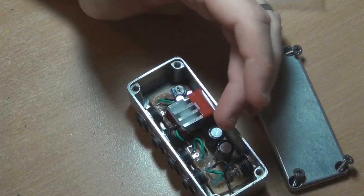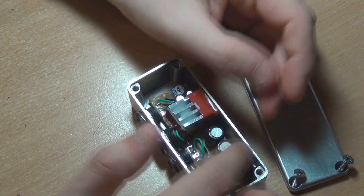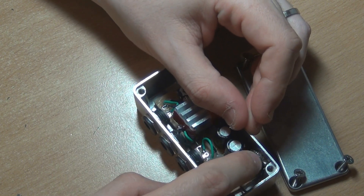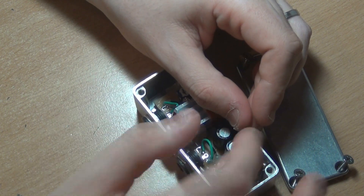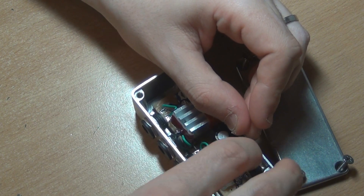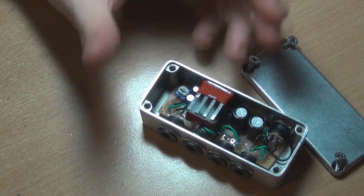You've also got to connect ground to just one point. I've gone off with a bit of wire and wrapped it around the nut of the input DC jack, then tightened the nut to hold the ground wire onto the enclosure. I don't know how anyone else does it — that's just how I've done it.